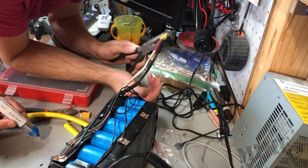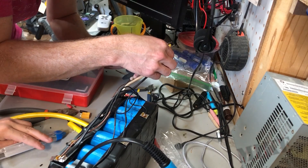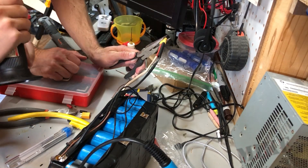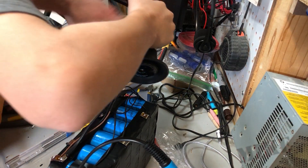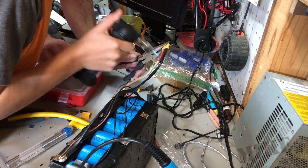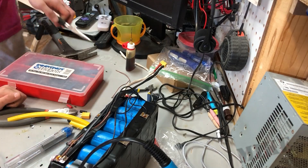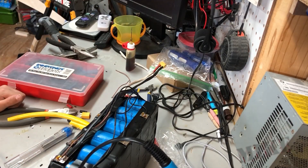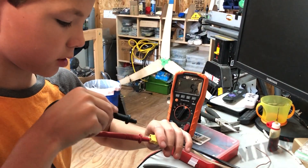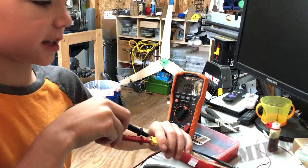That's a battery pack! Now we just got to make it pretty up here. We'll do the heat shrink — avoid the red side, go back and forth up and down. Battery pack — do a voltage check. We're looking for 19.2. We're reading 18.88. That's close enough, I'll take it. Awesome.